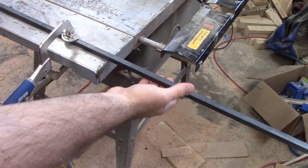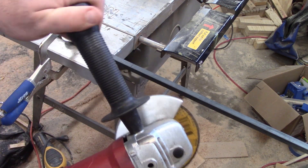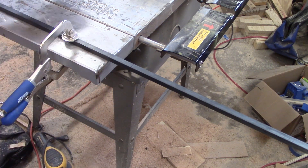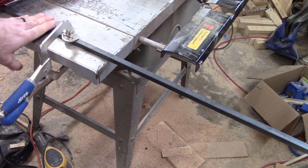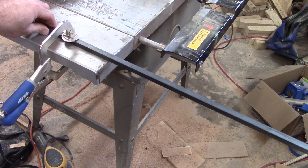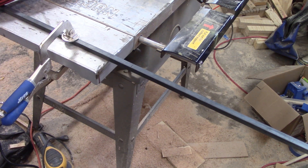I've got my piece of steel here. I've got an angle grinder with a cutoff wheel on it. Make sure you have your handle on, use both hands as you're cutting - these things can get away from you and do a lot of damage, so be careful. Grip your workpiece down before you start cutting, make sure it's good and secure. Wear safety glasses and honestly you probably need to be wearing a face shield as well. I've already had one piece of metal fly in my eye a long time ago and it's not a fun experience. I always suggest wear proper safety glasses and a face shield if you're doing a lot of metal cutting.